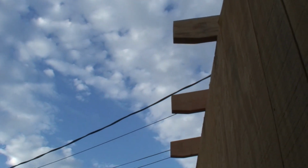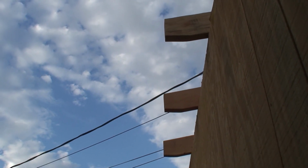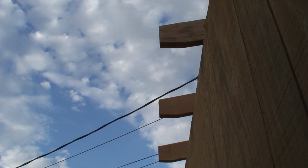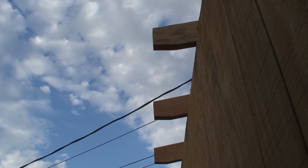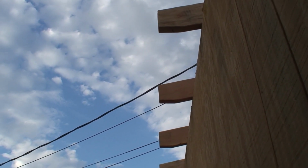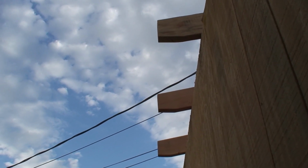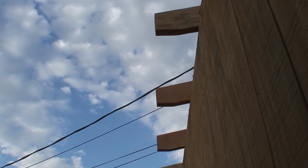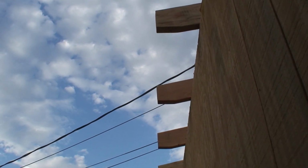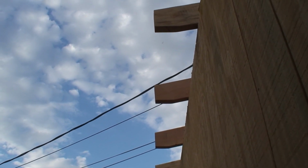I just have to run a line across, the chalk line, level line, and just make sure the rafters are within a 1/16 of an inch, in order to put the fascia board on reasonably straight. And then that fascia board will be up to the height of the top of the roof sheathing. The roof sheathing then will go up against it, fascia board on all ends. Okay.